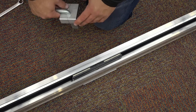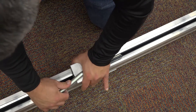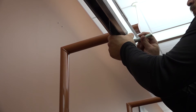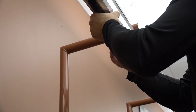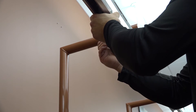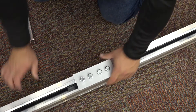Then, insert the installation tool inside the slide of the busway at the joint. Position the collar around the busway housing. Using the lever, rotate the installation tool and release. Work toward the end of the bus connector until the copper blades are firmly seated into the channels. If the copper blades are not seated, repeat these steps. Finally, remove the installation tool. Center the bottom housing coupler over the joint and tighten the bolt securely.